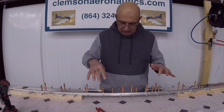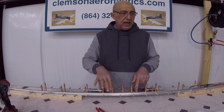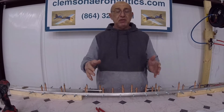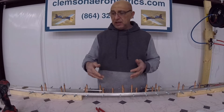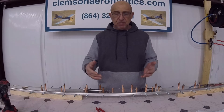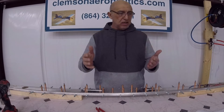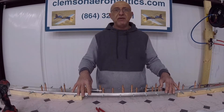Now we're supposed to drill the two quarter-inch holes. The plans call for using the drill press, and I suggest following the plans. I used a 15/64" drill first to drill through, then used my quarter-inch reamer to get it to size. It's perfectly perpendicular. I don't know what these holes are for, but evidently they're very important, so I wanted them perfectly round — that's why I used the reamer.